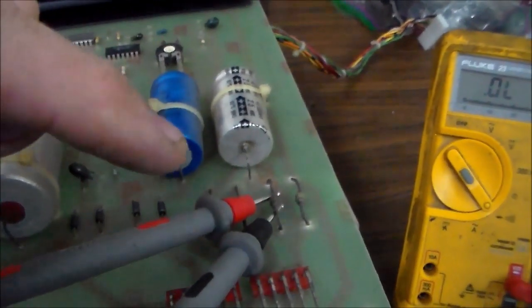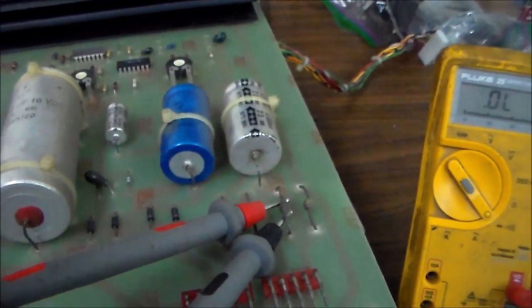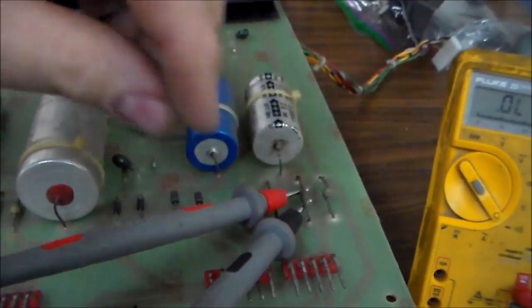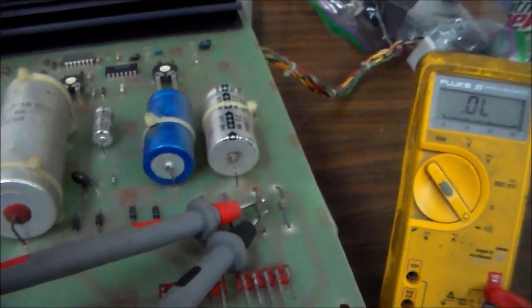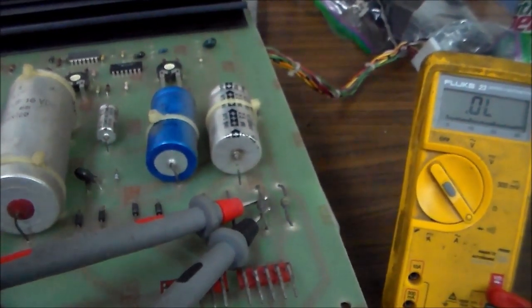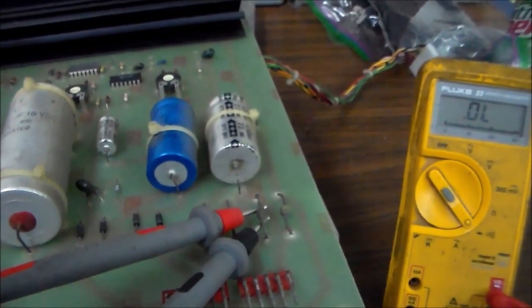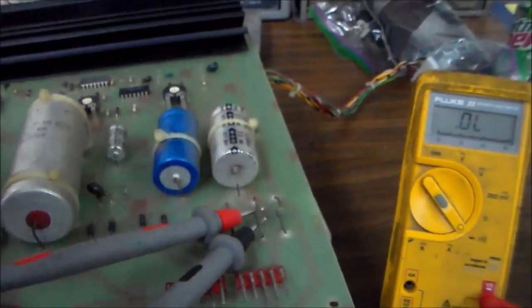And whenever you reverse it, it shouldn't allow power back through the other way. Now, sometimes it will, and it'll end up saying the same 0.4 through 0.6. Typically, though, that's because of the way they're arranged on the board. So to test them perfectly, you need to take them out of the board. But when a diode fails, usually it will either open all the way up where power can't get through it, or it will short together, basically connected to both sides, shorted together in the middle.